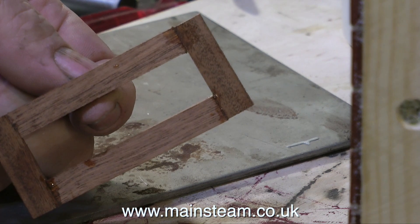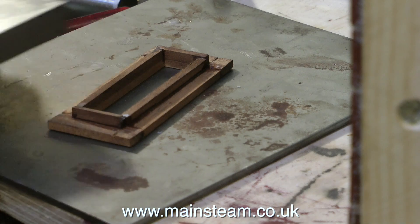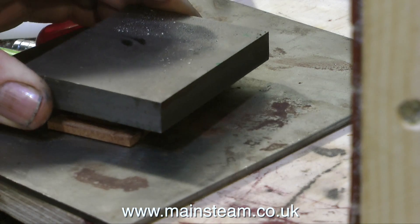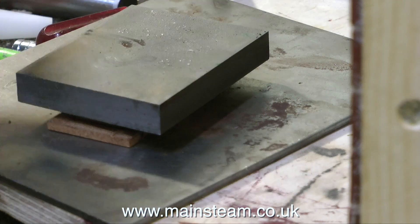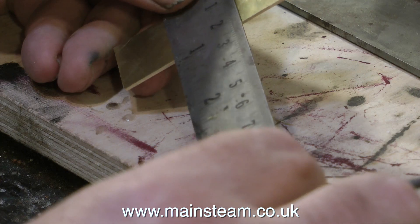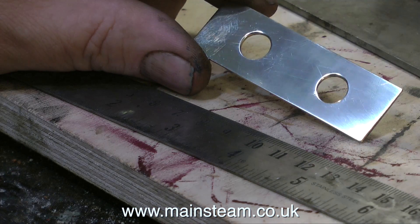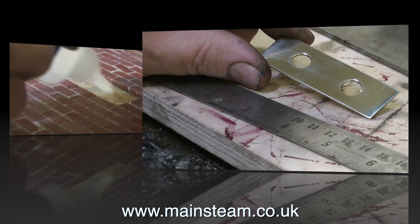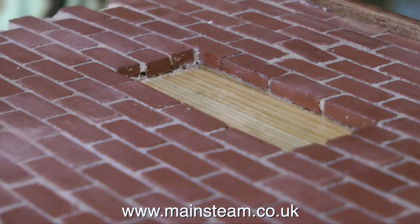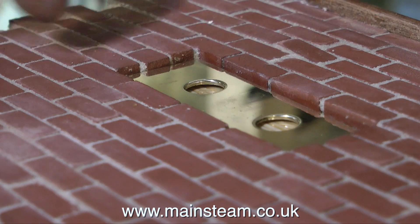Now I haven't mitered the corners on purpose — I did not want a window frame look. For the moment the part is sat on a metal plate with a heavier piece of metal on top of it to hold everything together. While the cyanoacrylate adhesive was drying, I made the metal plate. Drilled a couple of 3/8 holes in it and it looks like this. This brass plate is really going to be held in by the water fittings, as well as the wood around it, but I thought I'd put some cyanoacrylate adhesive in and hold it all together first.